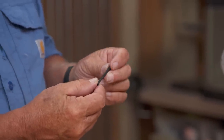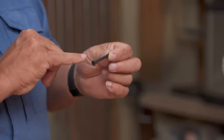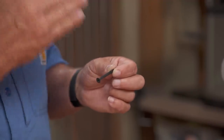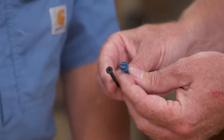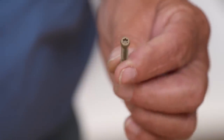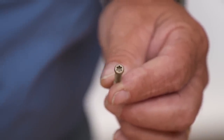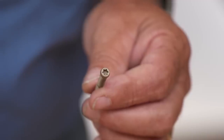If you're screwing something into hardwood, you want a different thread. Drywall screws also come with a fine thread for screwing into steel studs. People are familiar with the slotted head — the flathead — and the Phillips. There's also Torx, which is a star shape in different sizes. I prefer the Torx head because they grab well and don't strip out. So those are the different types of heads available.